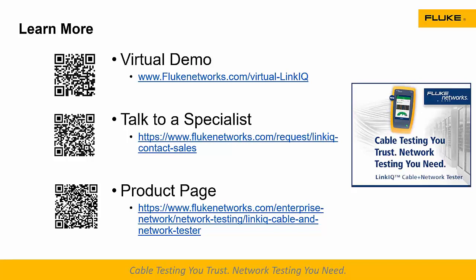The LinkIQ is a modern tester. CableIQ didn't measure up to 10 gig because 10 gig didn't exist when it came out. I certainly see people stepping toward 2.5 gig now. Power over Ethernet has gone up to the BT standard. I'm sure there are people on this call who bought a tester from us more than 10 years ago, so we want to make sure we're making a tester they can be using 10 years from now.